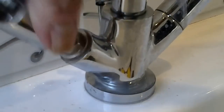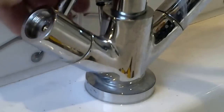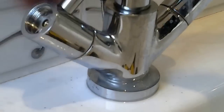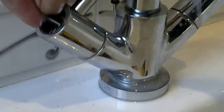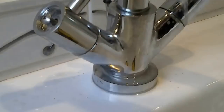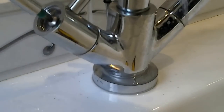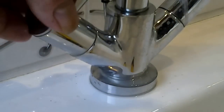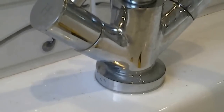When you're putting that back in the off position, just make sure it goes up with the tap like so. I think you probably want to come around one more notch - that's it, so it matches the other one. You can see they're both the same together. Then pop your screw in and we should be there. Put the cap back on. There we go - that screw's back in there and your tap should be done. That's how to do those little ones.